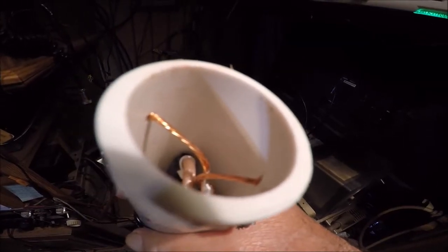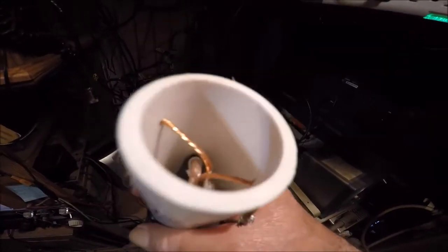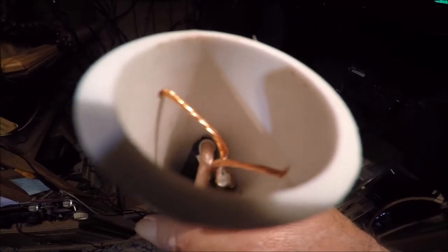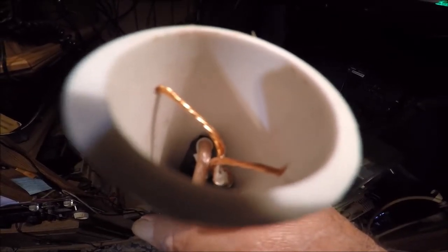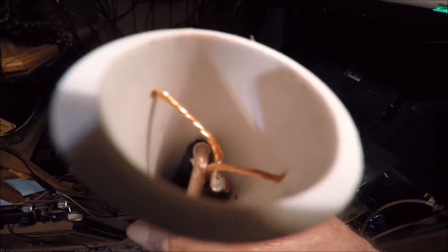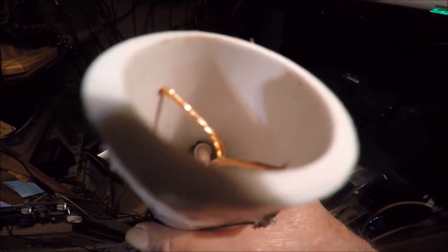It's a pain because you should never take things for granted. I did test it before I even installed it and it wasn't showing a short, but once I hooked up the wire, the slight tug on the end drew that half-wrap coil together, making the two ends bridge each other — and that's it.